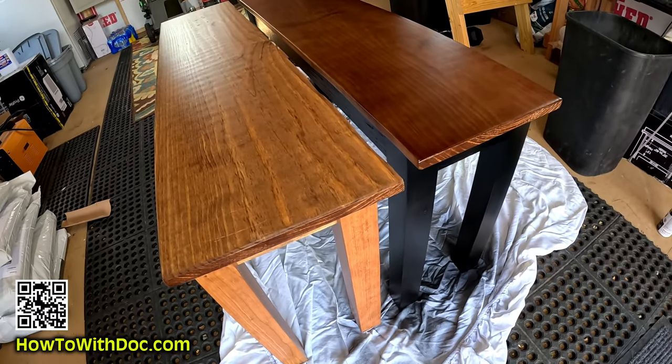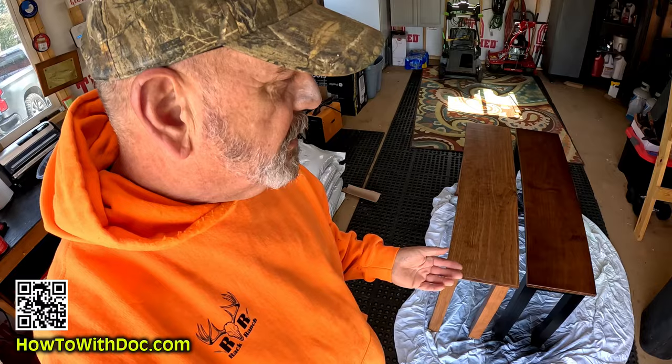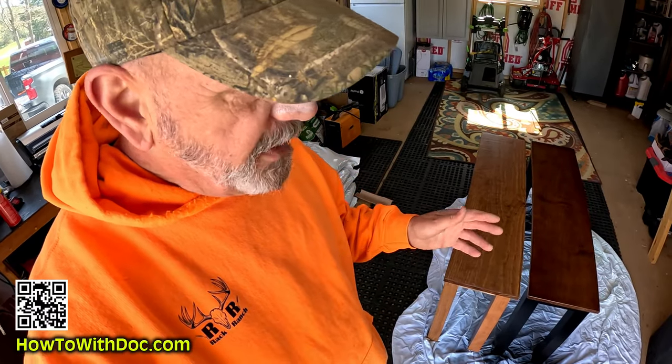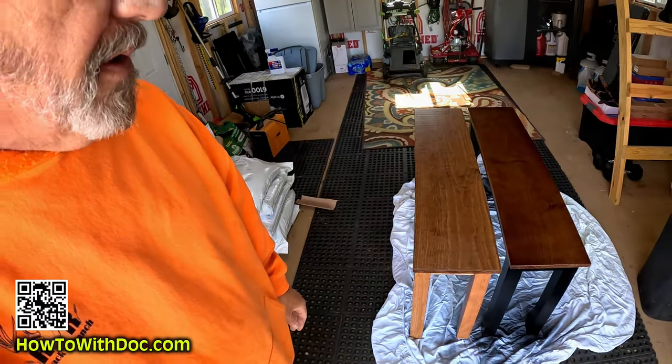See the difference? Isn't that cool? This is a really cool way — if you have some furniture that just doesn't go with your set, you can actually darken it up. What you want to do is check the colors on the Mohawk website and pick which ones you think are going to work. Pick a couple and then do what I did — do some tests on a plain board. I would not want the mahogany; mahogany turns purple red. I actually used that on a mahogany piece before, and man, that's going to look awesome.